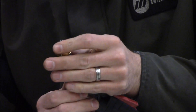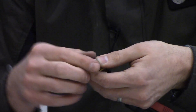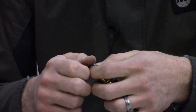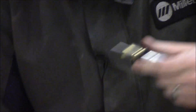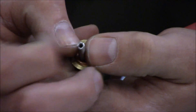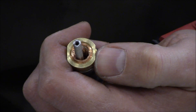It's important at this point to look at your cut. If any of the cut edge — that burr on the end — is protruding or projecting towards the center of that circle, take a file, take an angle grinder, take something, and just polish that up. If it's carving into your wire as you're feeding, you're going to result in a whole lot of issues and a lot of buildup on the end. I've taken a file and cleaned up that burr edge so there's absolutely nothing that's going to interfere with the wire itself. Now I'm just going to reassemble the end of the gun in the reverse order that I disassembled it, then we'll move to the inside of the machine.